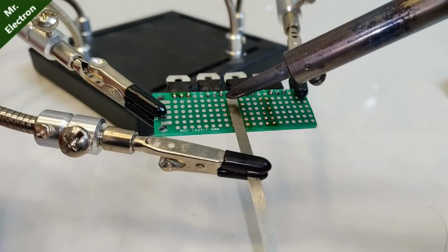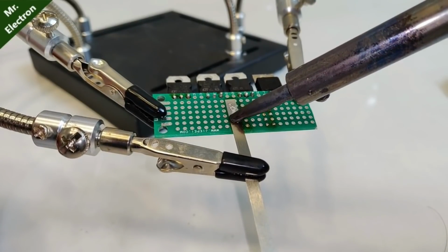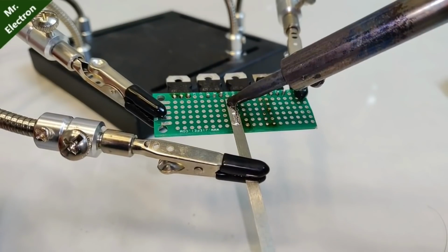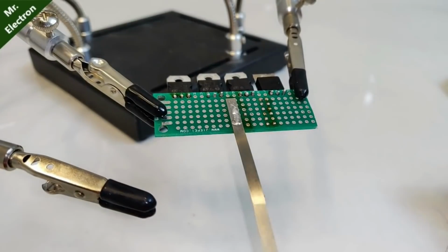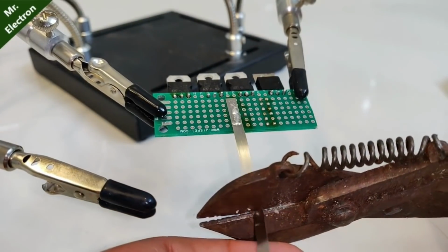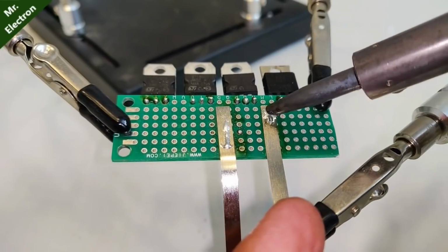After that, heat it with the soldering iron on the soldered slots so that the solder beneath the strips melts and sticks the strips to the slots. The strip can be reused from the initial strip by cutting it into 2 equal halves and using it for the second bus bar. Now do the same thing to the right hand side bus bar as well.